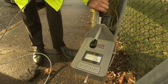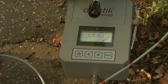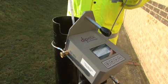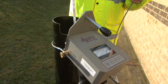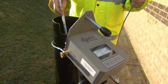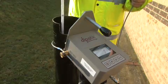Continue to the bottom of the column. This one's fine with no detectable corrosion in the root. The same cannot be said of this demonstration one — the Dipstick probe detects a serious loss of wall thickness caused by corrosion. This would represent a very unsafe column that should be removed quickly.